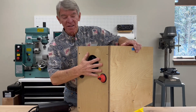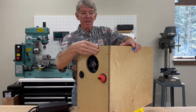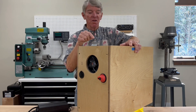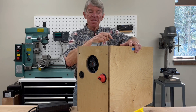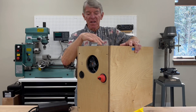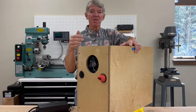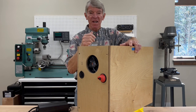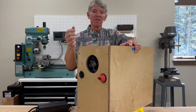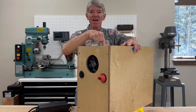In the back of this panel is a DC fan and some indicator lights. The purpose of that fan is to cool the box if any one of the units gets hot. Each unit has a thermal switch attached, so if any one or more of the units gets warm above a certain temperature that I've set, the fan will come on and these little indicators will tell me which of those units is actually activating the fan. So when anything gets hot in there I've got active cooling to pull air through the box and cool all those units.